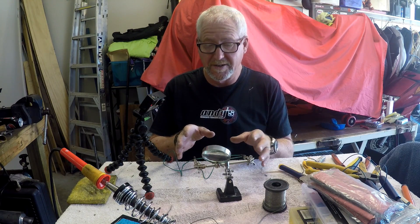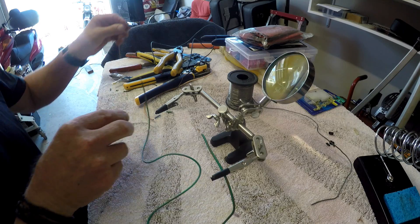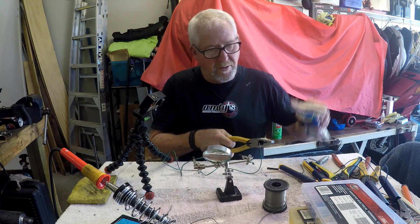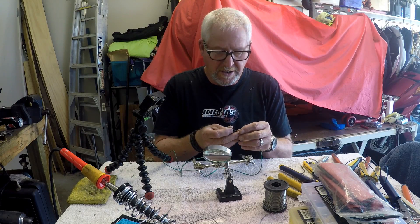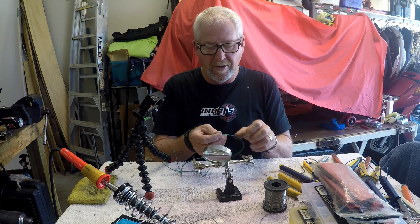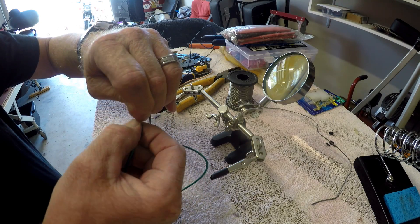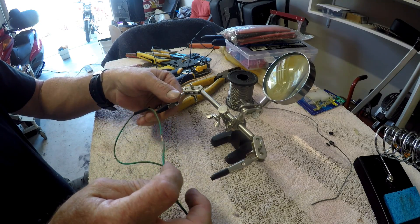I was going to go through the soldering exercise and I can see I've buggered that up. One of the things you want to do is make sure the joint is going to be electrically isolated, so we need to pop on a little bit of heat shrink. The way heat shrink works is that plastics have a memory — they start at a smaller size, and during manufacturing the heat shrink is expanded. When you heat it, you return it back to its natural state.